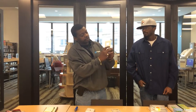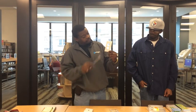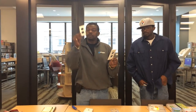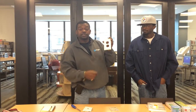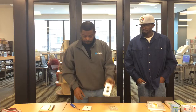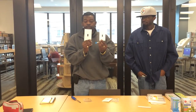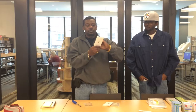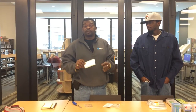This is what your outlet looks like and the plugs will be here. What we have here is an easy insulator. You use a flat tip screwdriver, take out the screw — you don't have to touch anything electrical. Take this and place it right behind your outlet. What it will do is insulate the outlet from the outside wall. The same thing goes for your light switches — same process. You take out two easy screws, you don't have to touch anything electric, and you place that right behind, and it will stop cold air from coming through. It's really more important than you think because a lot of cold air comes through those outside walls through the outlet.